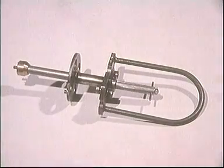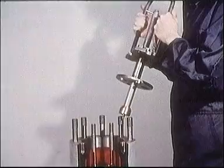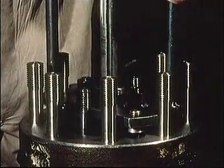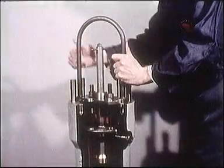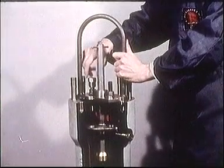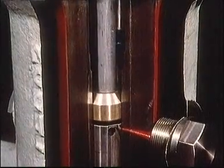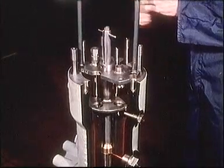The lifting tool supplied with the engine locks the plunger and barrel together in the correct position for dismantling. Place the lifting tool on the pump housing so that the guide lug enters the recess for the adjusting spindle. Secure the tool to the top edge of the barrel using 2 cap nuts. Press down the spindle of the tool and turn so that the pins of the spindle enter the holes on top of the plunger. Then tighten the spindle by means of the center screw.